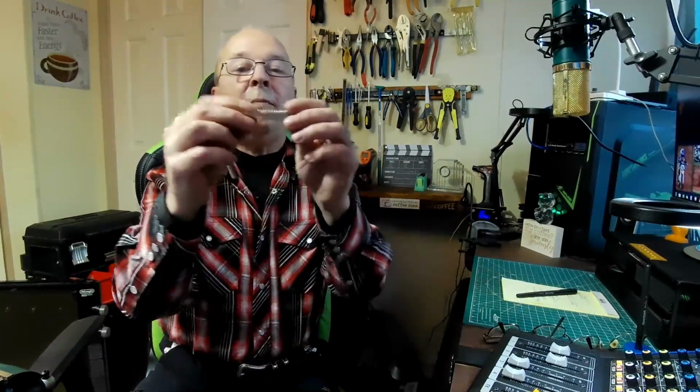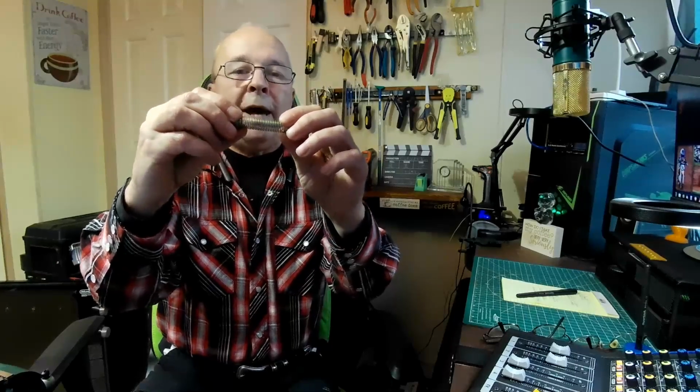This time, when I put the grease in there, it clogged up twice. And trying to clean it out was even more difficult because all the little pieces of solder were sticking to the grease, and now I've got to clean this out with alcohol. So I'm going to say it actually took me longer to clean this out this time, and I didn't take out near the number of components that I did the first time, and it took me longer to clean this spring. I think what happens is, see, when this opens up, you have all those gaps. And when it's together and you have grease inside here, I believe it's preventing the suction from getting inside of the spring to pull it through. And that's why it clogged up twice.